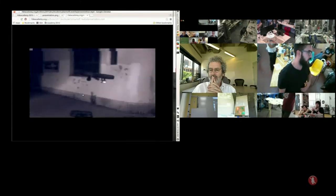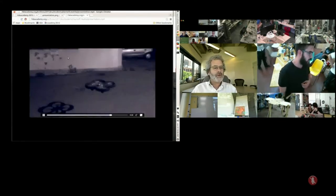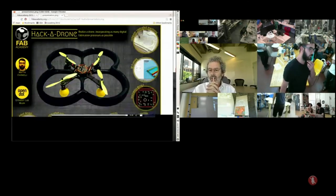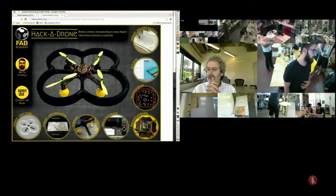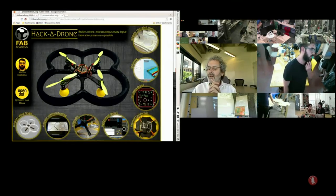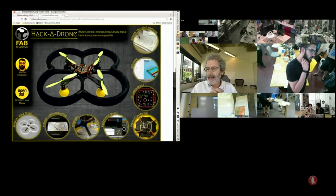My final project is a drone, and to make this drone, I tried to involve as many digital fabrication projects as possible. I used CNC milling to realize a protection structure, the laser cutter for the layers of the frame, which I then attached using epoxy bracing, and 3D printing for the foot and the battery holder. Also the output device using the IMU for the accelerometer, magnetometer, and barometer. And now I want to involve networking communication using a Bluetooth module to visualize the data on a smartphone.